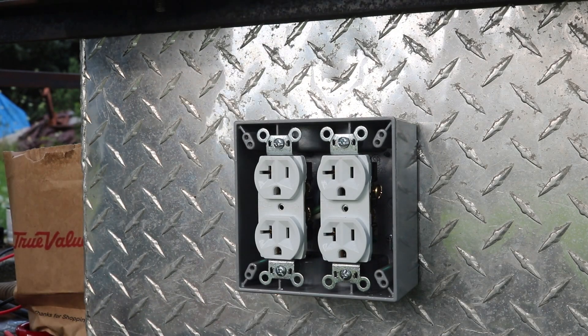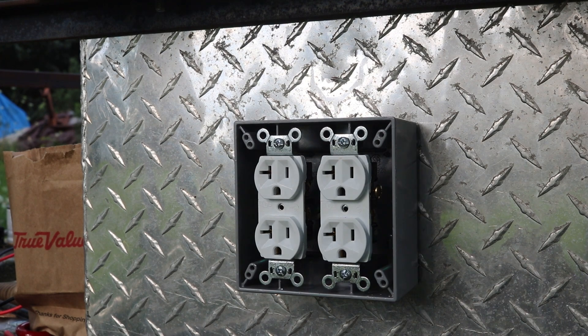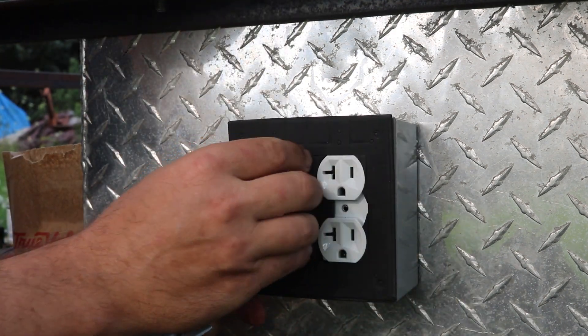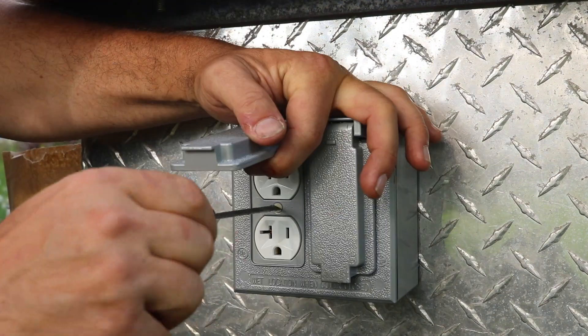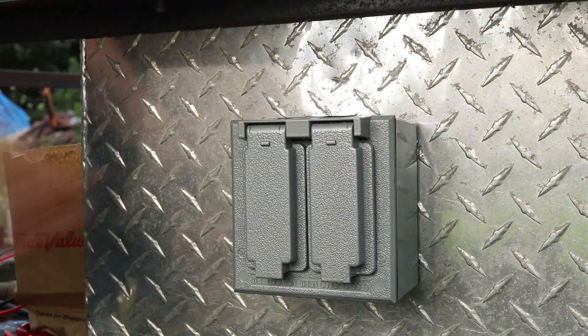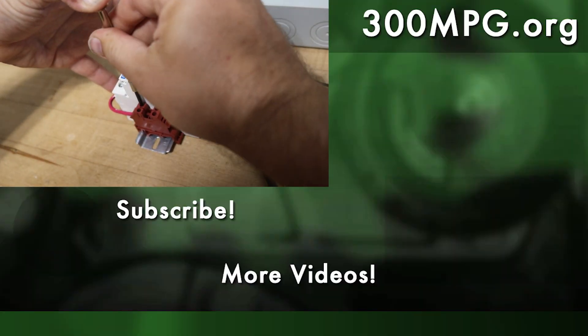After testing, I killed the power. I installed a second 20-amp outlet in parallel to the first, installed the foam gasket and the weatherproof outlet cover. Next time we'll be working on the DC disconnects, the combiner box, and wiring up the project in general.